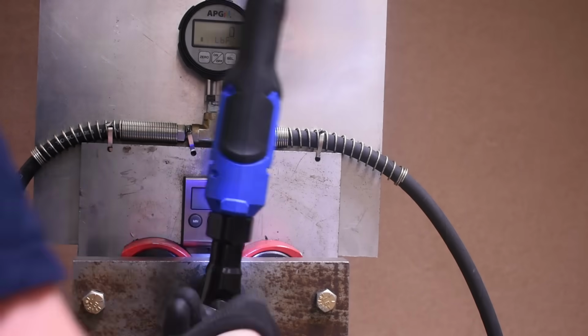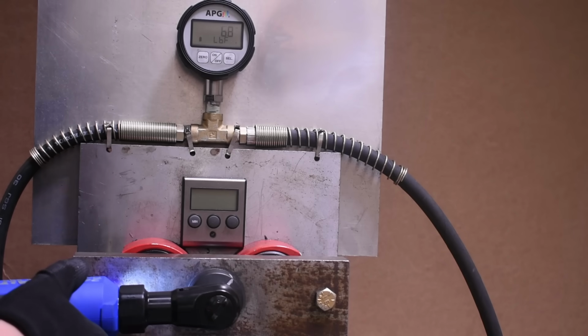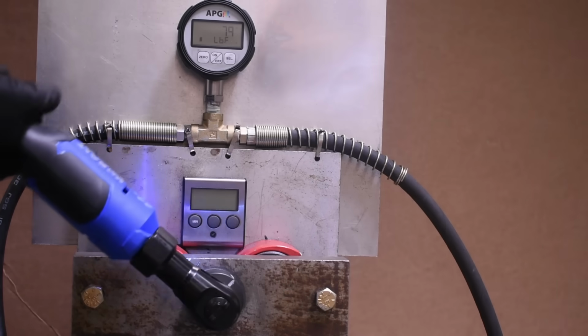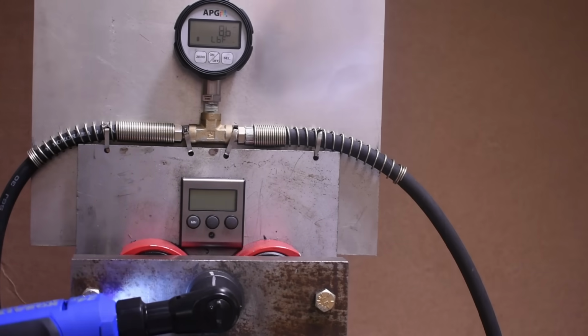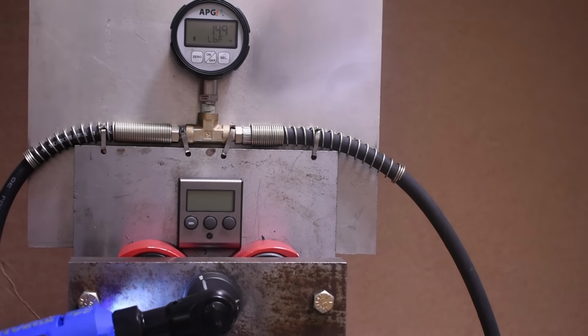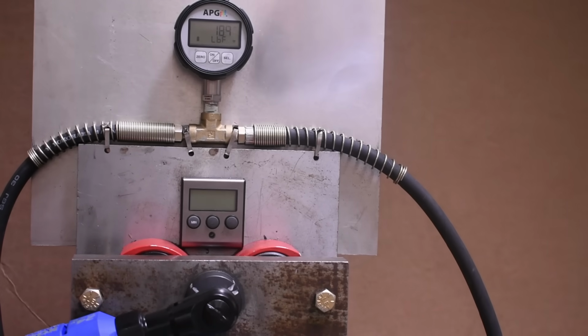Now here it is with a 4 amp hour XTR battery. 80 foot-pounds. 82 even. That's some beans for a cordless ratchet. Not saying battery size should make a difference on these tools, but, well, them's the numbers. The length of this tool allowed us to also use it by hand up to and past 200 foot-pounds. No issue. That's very good.